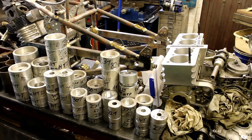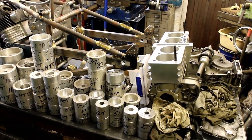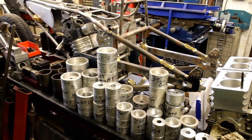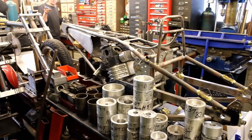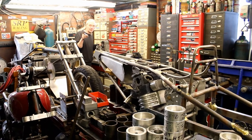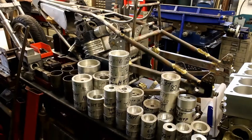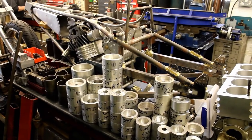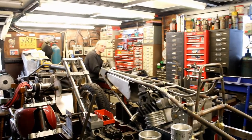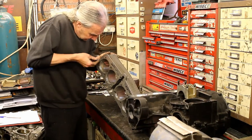I wasn't having a sort out - I was sick and tired of all them bits up on the shelf. What I want to do in the next period is set the dividing head up on the horizontal miller - I've got the tooth pulley and the cutter doing the teeth. You're basically converting these into pulleys - it's an imperial tooth cutter, I'll show you in a minute.